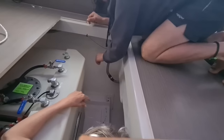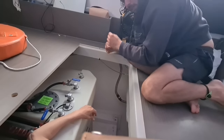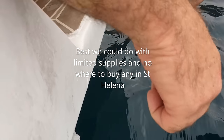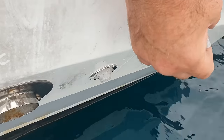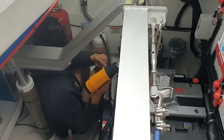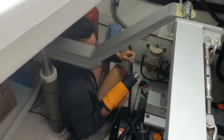There's a fitting that comes out of the side here going into a hull fitting. Where it breaks through the fiberglass, it's not leaking from the inside - it's leaking from the outside. So we've put a cork that we've built up and sealed into the diesel heater exhaust. The cork only goes in so far, and we're trying to seal it on the outside with a plug to stop water going in. On the inside, connecting a hose pipe taking it higher to stop water going up - double protection.